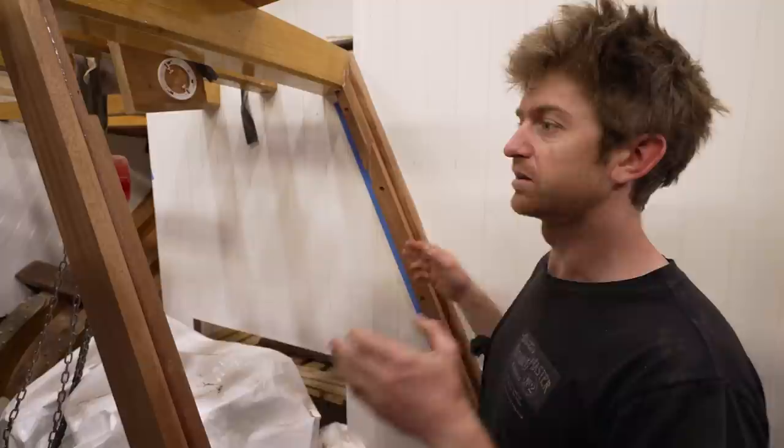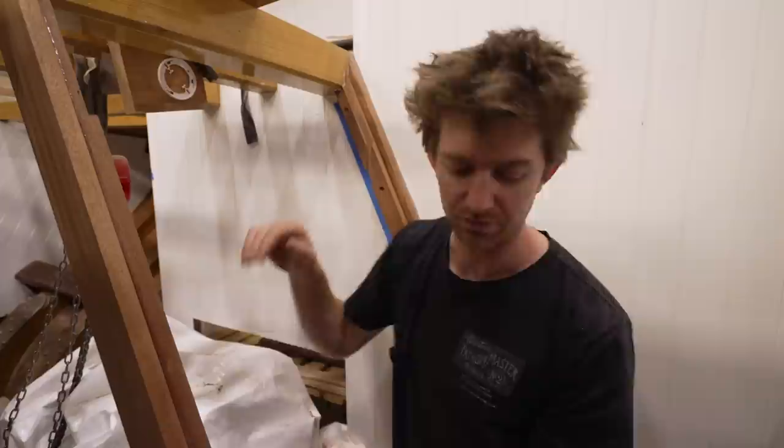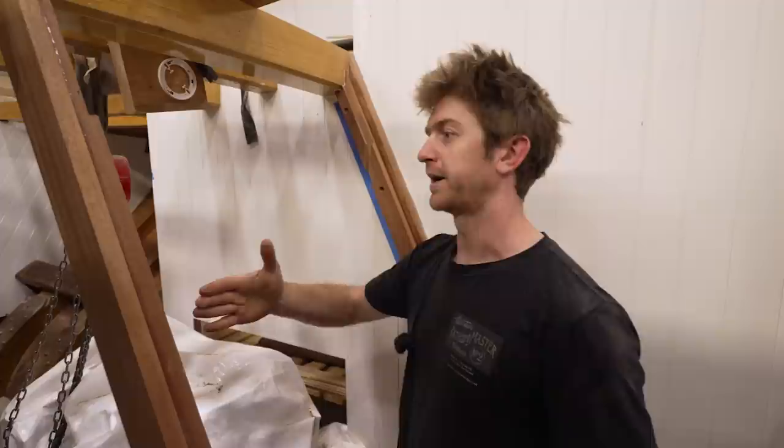The panels will sit on these pieces here, and there's going to be a gasket there, and then on the outside there's a gutter, so any water that gets around the outside will end up in this gutter, run through a hole in the ceiling board and into the bilge. These rebates at the top here are for a small panel here and then a vertical panel here, which will meet up with the big engine bearer down below, and they'll all be watertight as well, and this vertical panel will have electrical components mounted on both sides of it.